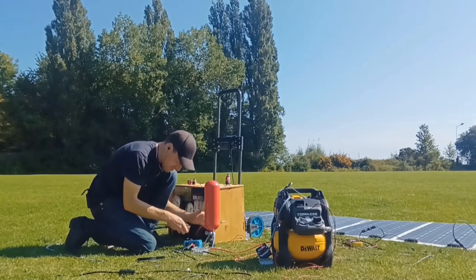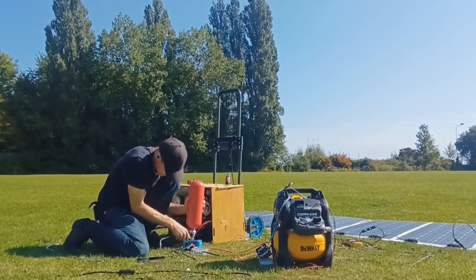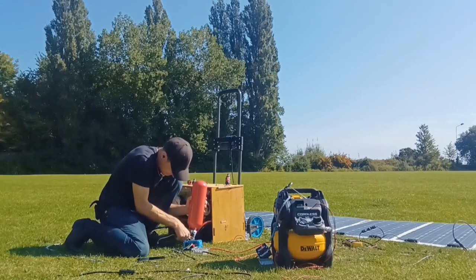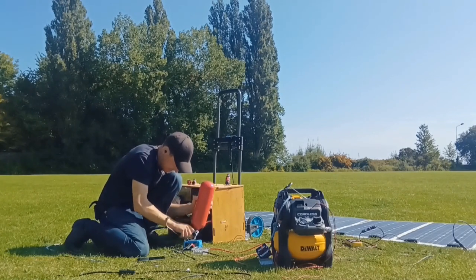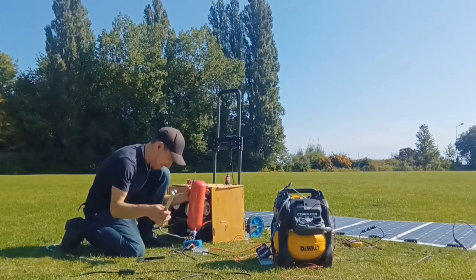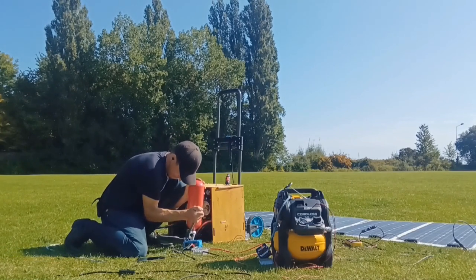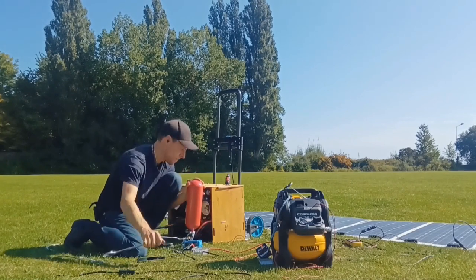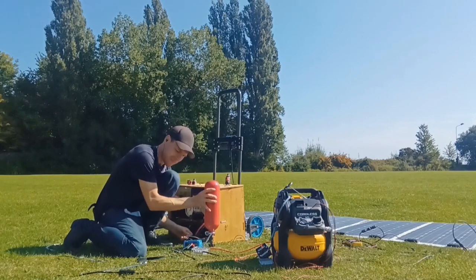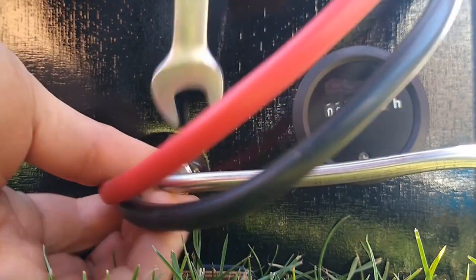This is the secondary storage. Watch my video about two-stage compression: you have two half-empty bottles and you want to make one full bottle. You branch one on this side and the other on the other side — one ends up full and the other completely empty. These fittings should be tightened thoroughly but not too much. Every leak is a loss.